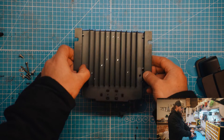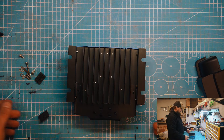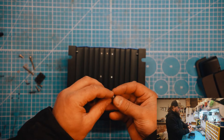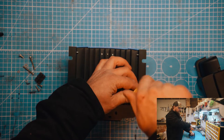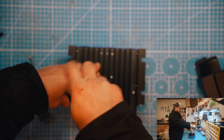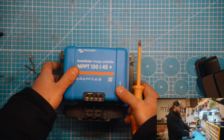What this thing does is it sits there between the earth or ground screw on the side of the chassis and the other screws that hold the front blue plastic cover onto the chassis. To secure this on here, it takes what I think are M4 grub screws or bolts. You put a little washer on there — they come with a washer — and they go into those holes that you've just removed those plastic blanks from. That tightens down, and then we repeat the same process for the other side. Sometimes when you first put these screws in they can be fairly difficult to get in because the thread is fresh, so be wary of that and don't cross-thread.